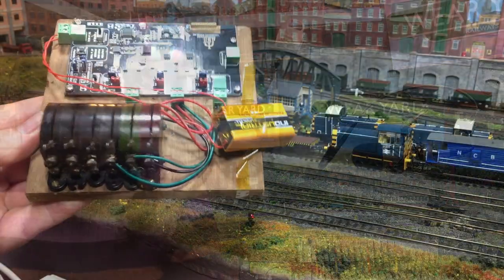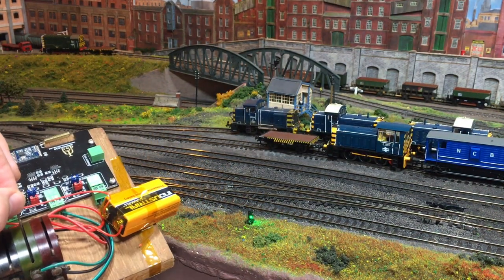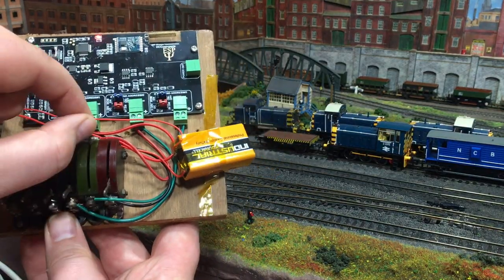What's important to think about these is that there are certainly a lot of uses where this product simplifies something that you would otherwise need a lot more circuitry and wiring to do — it's all about cutting out the wiring. For other uses, such as the wire-free control panel that we've shown today, this is something that is pretty much unique to this product. And because of the way it works — wire-free, not wireless — it doesn't suffer from any of the issues that a wireless network would do. If you went to an exhibition and used this, and everybody else in the hall was using the same system, there's no crosstalk, there's no interference, they would all just work. I've seen a layout with over 50 of these sender units in place in one room, all working flawlessly.